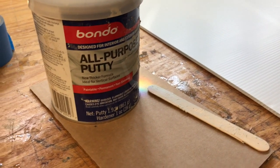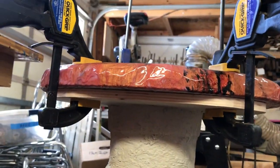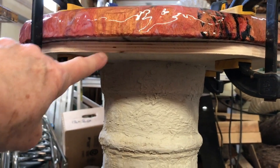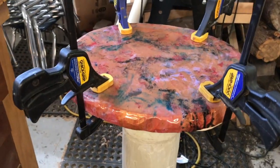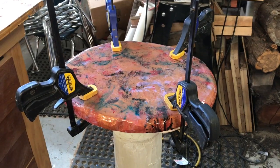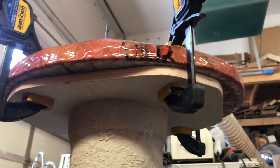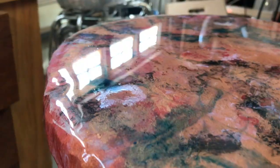I attached the pedestal to the bottom of this granite using epoxy, and on this piece I've attached another piece of wood screwed in to really make sure it stays on the pedestal — that's what I've glued the granite top to. I'm about to take off those clamps since it's been over five minutes. I'm going to flip this upside down and add Bondo to the underside of the granite and to the underside of the tabletop so there's continuity between the two.